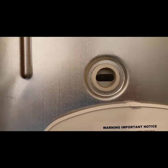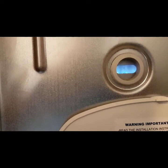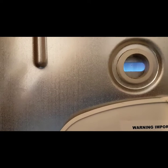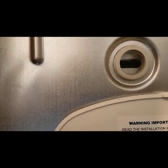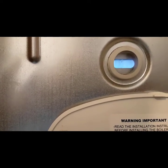So this is what's happening in central heating. It will come back on now — see it fire back up, the flame's high. Now I want you to listen carefully because it's going to repeat, and you'll hear the fan stop. Listen very carefully — you hear the fan stopped, the fan's gone off, then the fan's started again. So it's just repeating that behavior. That's the problem.